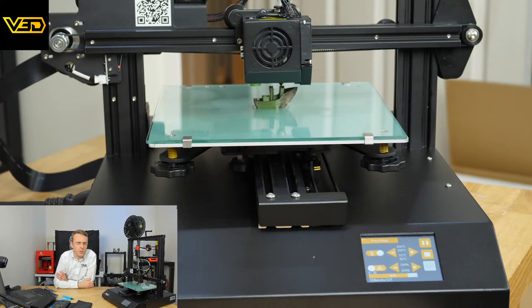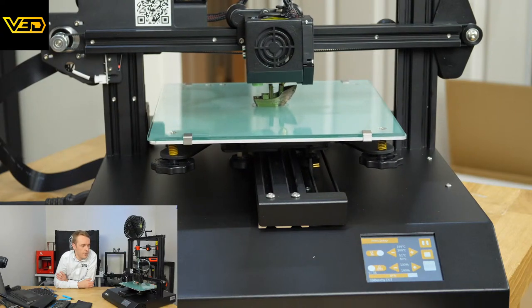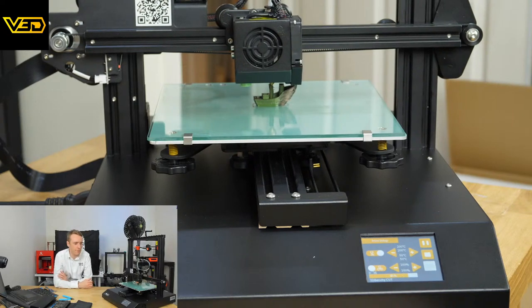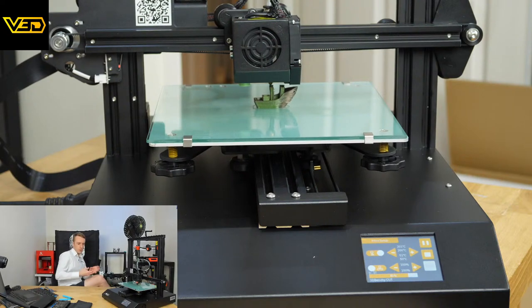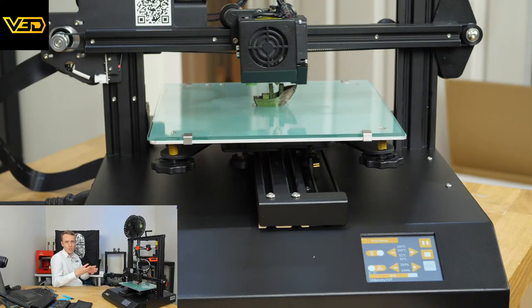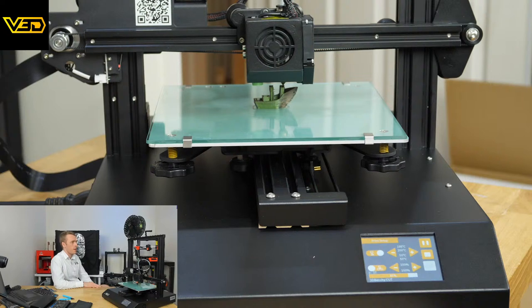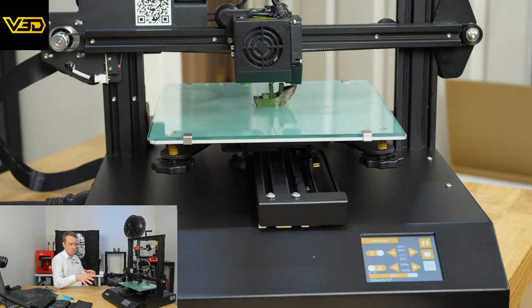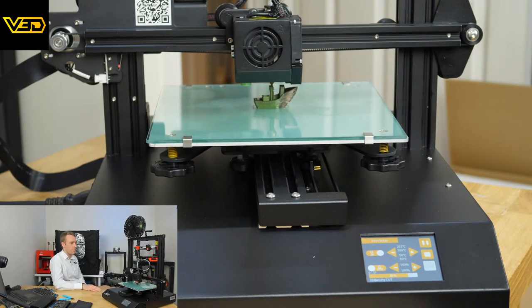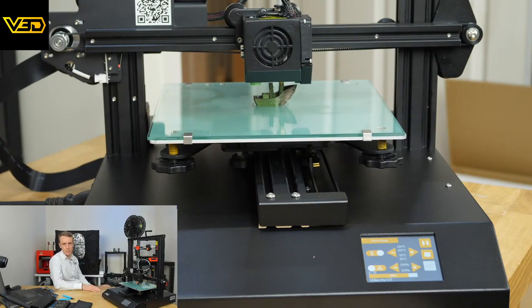Yep, TPU as well. TPU is one of those strange materials where you don't really get much assistance from having a flexible bed, because obviously TPU is inherently flexible. Depending on the geometry and density you've printed, you can end up with quite a rigid part if it's very dense, with lots of thick walls and high infill. But because it is flexible, if you try to flex it off the bed, it can just grip to the bed and you don't get anywhere. So having a release agent can be useful in times like that.